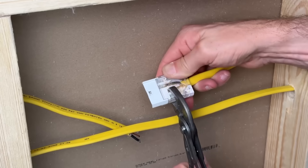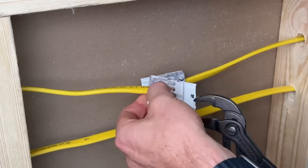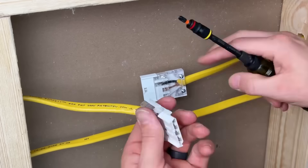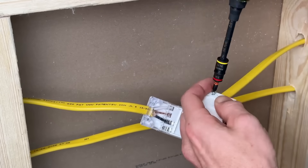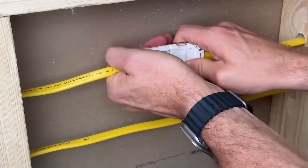To install, take your pliers and not too aggressively pinch that top casing on. There's a little cradle that presses the wire onto each one of the forks, and the screws go through the white housing side — not the clear side — to pull everything together and make it tight. Once you have that, just plug each side together and you have your completed circuit.